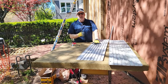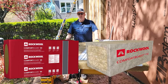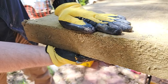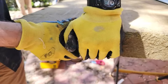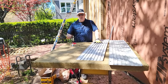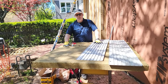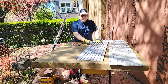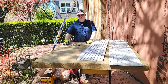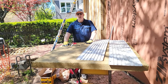On the foundation walls and on the roof we're using Comfort Board 80 and 110 respectively, depending on where we're putting it. Underneath the slab we use the Comfort Board 110 — a little bit stronger PSI. This one is even more dense than those and is designed specifically for roofing. So we're using this Rockwool product — there are lots of different Rockwool products you can use on a roof, and sometimes we'll use the Rockwool Top Rock if we're doing some sort of membrane on top. In this case it doesn't matter because we're putting this decking on top of it, so this pan is going to go directly on top of this.